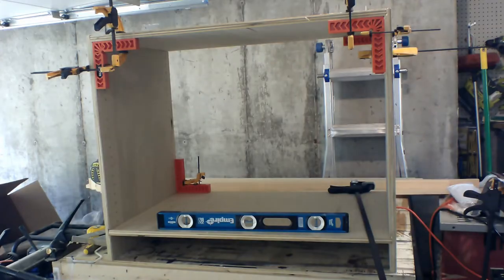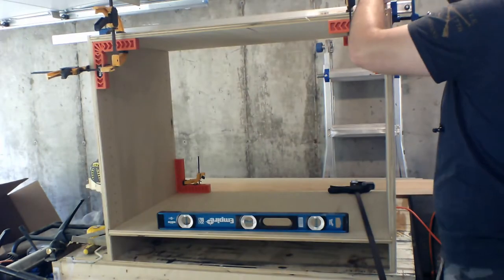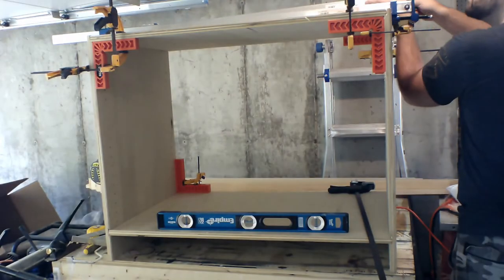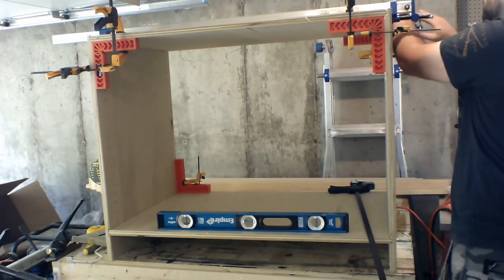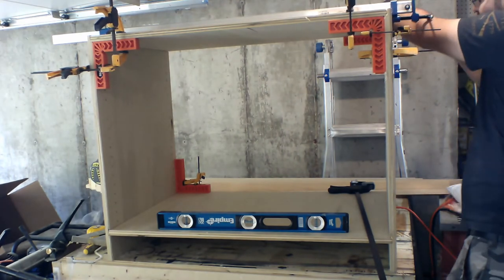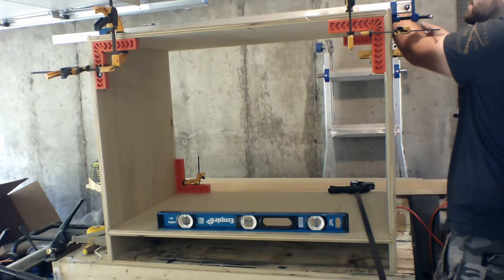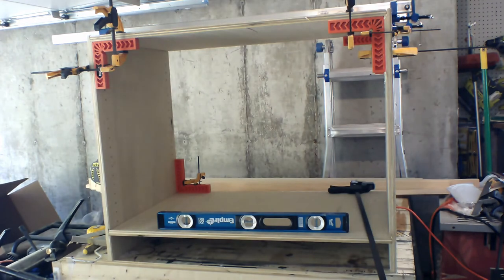So you're going to have to clamp this project. You have to make sure, because the finish nails go in, but they're just kind of there. It does keep the project together, but the wood glue is really what you want to hold everything together. And then, of course, you can do a crisscross where you nail down and across into that wood to make sure that it doesn't separate. Only a few nails up top are needed to prevent that. You can even use a brad. Just make sure the brad's really going to get into the project.